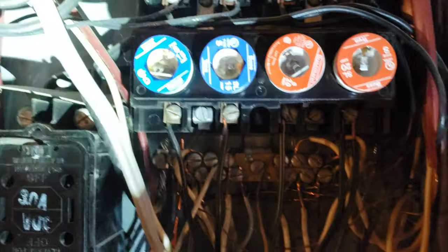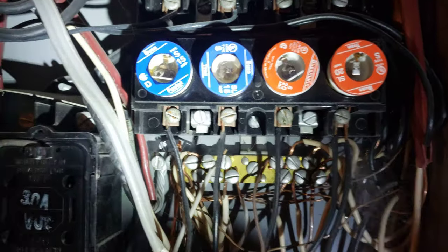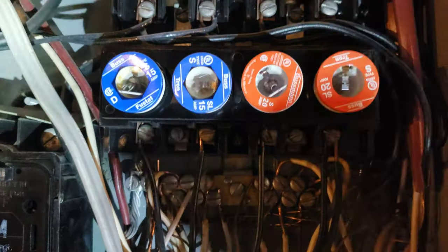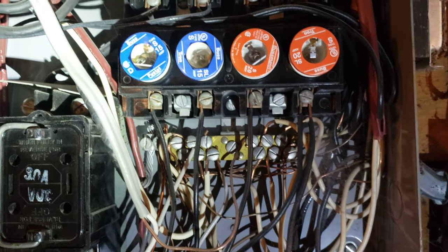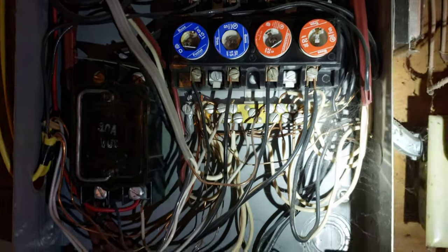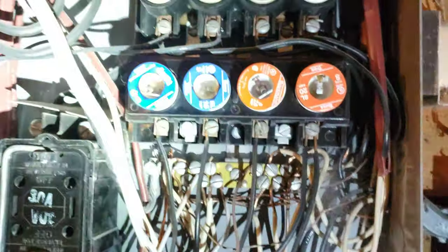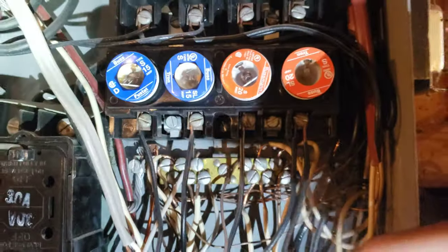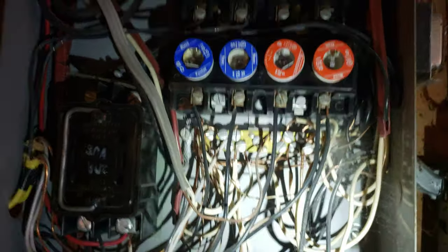Say this is a kitchen circuit with a toaster and everything else running on it and it keeps blowing fuses. Somebody comes down and swaps in a 20-amp fuse into that 15-amp circuit — now you don't have a blown fuse, but next time it could fry the toaster, heat up the wires, and start a fire. You can put oversized fuses in the same socket, or people put pennies or steel in there to bypass it — then you have no overcurrent protection at all.